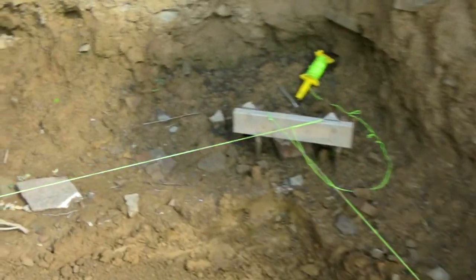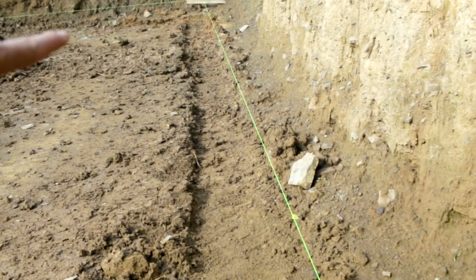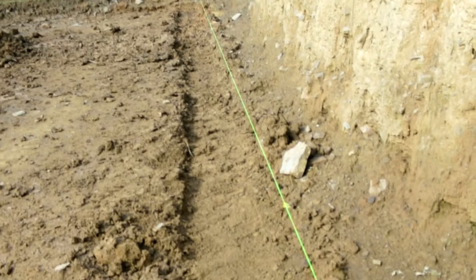Back along this back corner here, this is really good — nice and dry all the way up through here to about this corner. Over to about there is where we have our water issue. We are going to put stone all over our footer because we are having such an issue with rain — it's been dumping almost every single day. We had to cancel our excavator for the footer and french drain lines. That's why we are going to use clean two stone in the footer, because everything is still damp. We are going to tamp that to help knit the stone down into the footer base and make a solid connection. We have hand leveled this out and we are going to dump some stone in and get it tamped in.